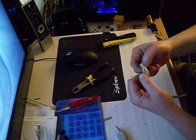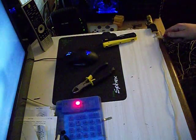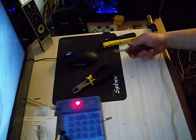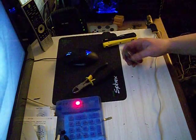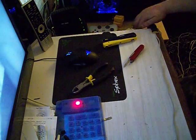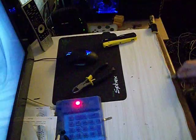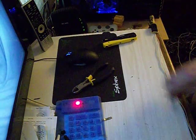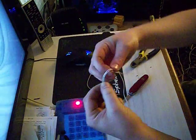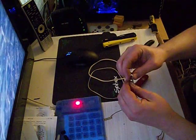That's really quite easy. After I get the wire out, I have this thinner stranded wire. I use a small pocket knife — the smaller the better, because if you're going to slip and cut yourself, you don't want to slip with a 6-inch long blade. I have a little clamp, clamp it to my desk, and I just run the pocket knife down it, just like filleting a fish. Cut it, fold it in half, and out comes bare bright.